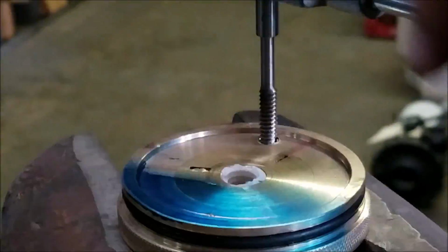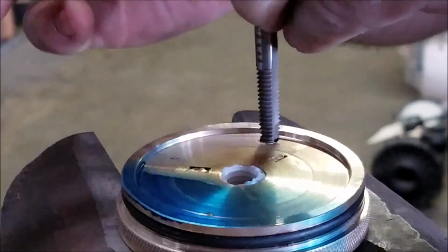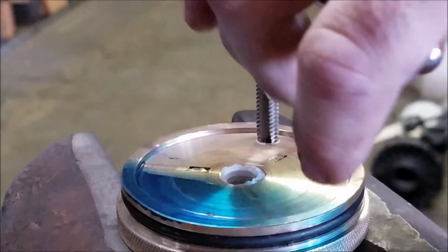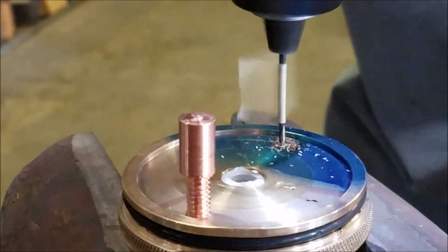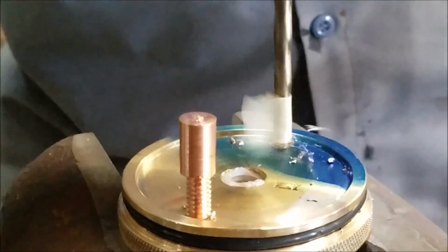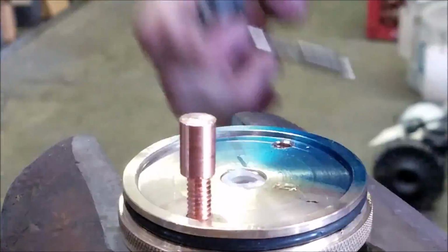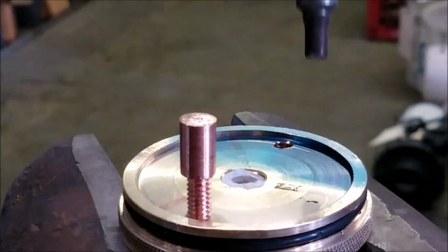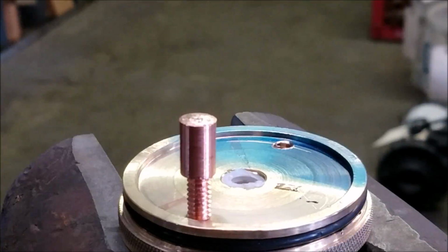And I actually chose not to put in a bunch of video of me sitting there just trying to lay out the deck, just even for that one little line you can see in the blue. That blue is actually layout dye. It's basically like an alcohol-based dye that you can put on. You can either brush it on out of a container or spray it on out of a paint can. We use the spray-on type at work.